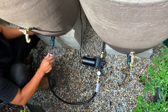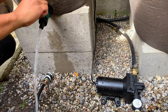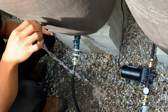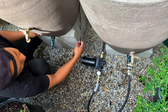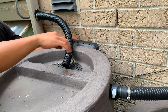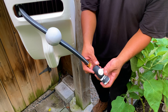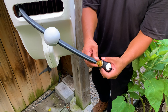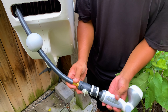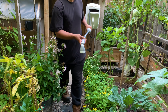In order for this to work I needed to increase the water pressure coming out of the rain barrel, so I installed a 50 psi water pump right next to the rain barrels. With the output end of the water pump I'm installing the extended hose connected to the hose reel, making sure to tighten everything so there are no leaks. The other end connects into the rain barrel. Since I have two rain barrels I attached quick connectors to easily move from one to another. One barrel is one foot lower than the other so when the first fills up the excess flows into a tube going into the second barrel. The water pump requires power but will automatically stop once it reaches a certain pressure and when not in use. I also installed a cover to prevent water damage to the plugs.